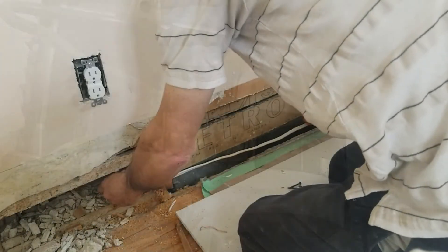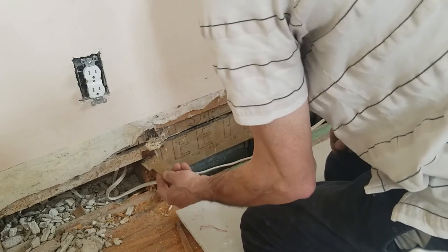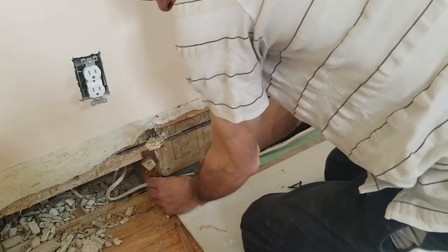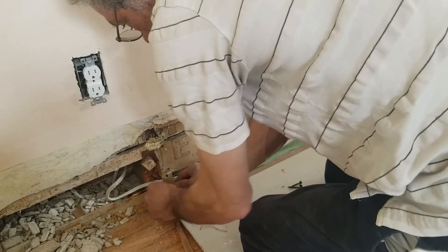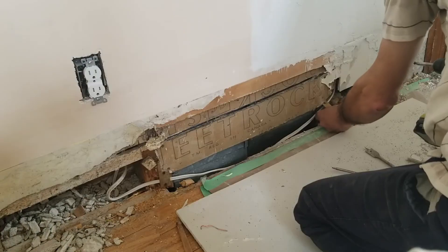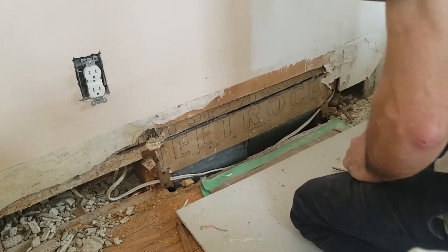Once you have your wire over — if ever you have to do this, and sometimes you have to — always go over your 2x4s. There's some kind of steel plate, and what this is going to do is prevent inadvertently putting a nail into it. I'm going to put it right around there. Let's get a screw ready. That's a done deal.